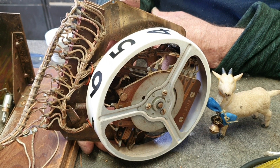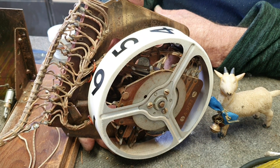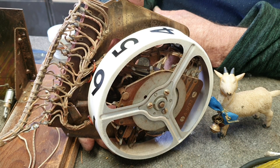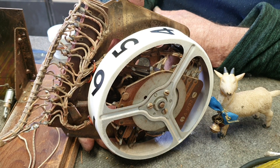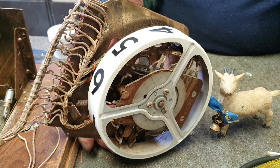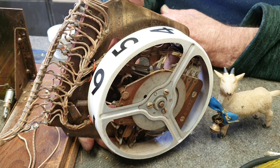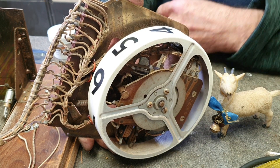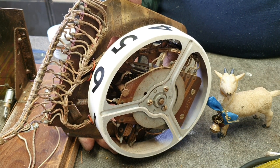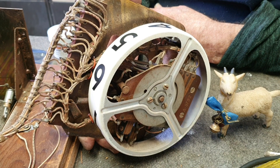So all in all, that's how you disassemble, rebuild, and adjust a Rattrap score reel. One thing I forgot to mention — that printed circuit board: we did apply a little bit of PBR grease to it, which helps greatly. That's really the only place you need to put any lubrication, and mind you that's a special PBR grease. We hope you enjoyed this video — please give us the thumbs up and subscribe to our channel. This has been another GoatShed presentation.